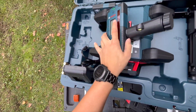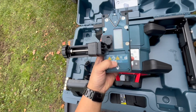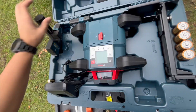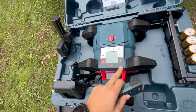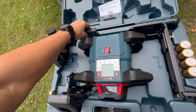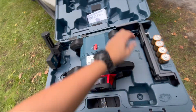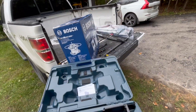Here's the receiver, which is pretty nice — you can receive from this side, and it'll tell you readings up or down on this side. They also code it with sound. Here's the remote; you can also do it from Bluetooth with this particular laser, which is nice if you're far away and trying to set grade. And here's the wall mount, but I don't think we'll be using this — I got a tripod.